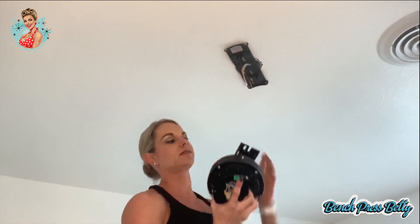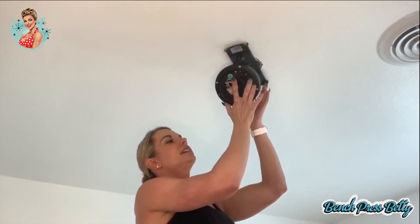There's the green one, which is the ground or copper wire. There's the white one, which is your negative. And then there's a black one and sometimes a blue one. If you have a separate switch to turn the ceiling fan on, isolated from the light, then you would want to match black on black and typically the blue with an orange color. If not, what I'm going to do is take the blue and the black wire and twist them together on the black wire — that way, as you switch on and off, it'll control the light and the ceiling fan. We find that hole on one side with the hook here, and this allows us hands-free so that we can connect the wires.